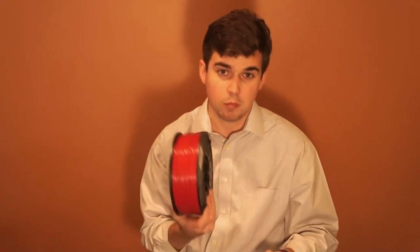The second thing that you'll need is ABS filament. I'm using red Maker's Toolworks ABS. You can use things like natural or white, but then you can't quite see where the solution's been applied, so I find that a bright color like red works best. Of course, the downside is that you're going to have red wherever you apply it, so if you spill the stuff it's going to be noticeable and it might adhere a little bit to the first layer of your prints. So if that's really a concern, go with clear or white. But for me, I just want to make sure I can see that it's still there — I care about it working, so I'm going with red.